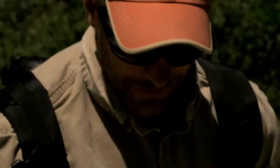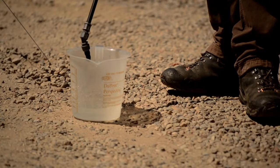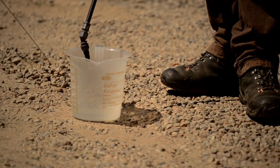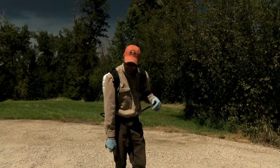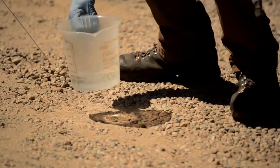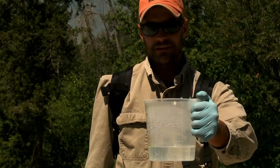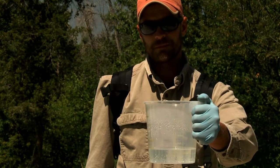It's extremely important to keep pumping your backpack sprayer and keeping constant pressure, the same way you did when you were covering the ground. Stop. So for 48.75 seconds, I sprayed 16 ounces, and that converts over to 16 gallons per acre.